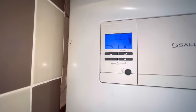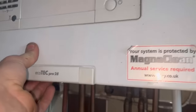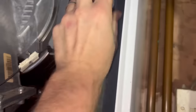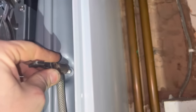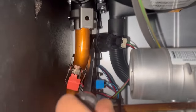To get started, we've got a breakdown on a Vaillant. The customer's having to put the pressure up to over three to keep it running — F74 fault on it, which is very common on a Vaillant. We'll get the case off, have a look inside, and find the pressure sensor located just below the heat exchanger. Always on a breakdown, if I've drained the boiler down, I'll check the expansion vessel to make sure it's charged — good practice to do that. This one was absolutely fine, and we put leak detector on the Schrader valve just to make sure it wasn't passing.